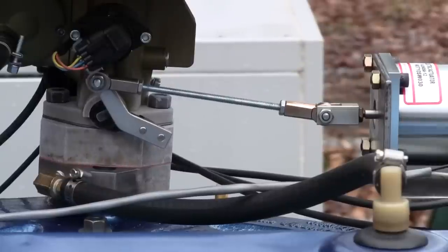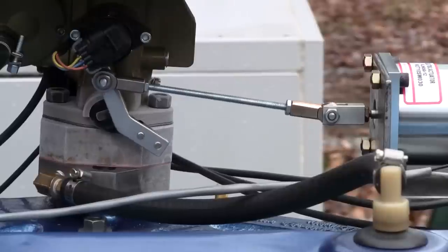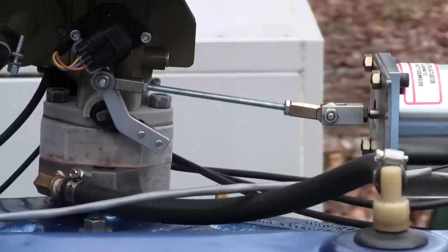That's 60 amps. I noticed the voltage kind of sagged a little bit. Yeah, we sagged down to 228. Might have to bring that stability up a little bit, or the gain rather, on the regulator. We are at 60.4, 60.4, 60.5, dancing around there a little bit. That's pretty respectable. I'm gonna drop that. Let it run no load and check our stability.